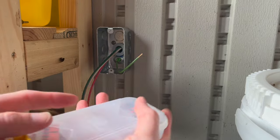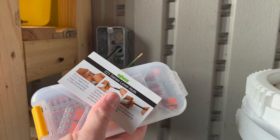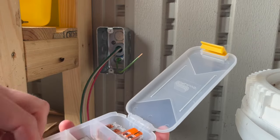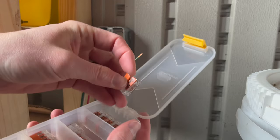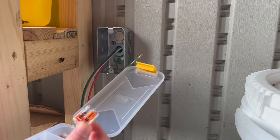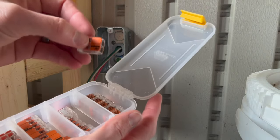These are the wire connectors I'll be using — they're called Wagos or Wago lever nuts. You use these in place of the typical twist-on wire nuts. I really like these because they're so simple to use. If you have five wires you've got a five wire connector, two wires you've got a two wire connector. You strip the wire — it tells you how many millimeters to strip — put it in the hole and snap the lever down. I'll link these in the description as well.